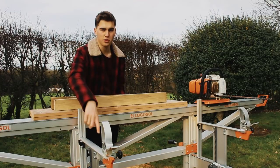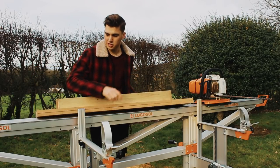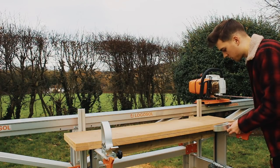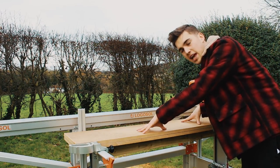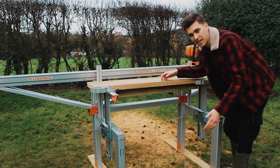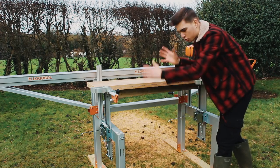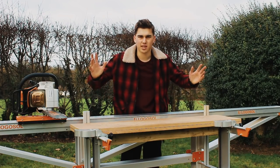The logs I had were just too small to fit on their own between the two log lifters, so I made a base which is basically two sheets of MDF supported with some two-by-fours screwed to it. I placed it on the log lifters, used the clamps to clamp the MDF to the jig, and then screwed the log onto the MDF. Technically this sawmill is a very large jig, and with jigs you can make other jigs to go with it. So if you wanted to cut some wood cookies, you could make a frame which connects onto the log lifters, goes down with a flat on the bottom, then back up — mount a tree vertically and cut cookies. There are so many possibilities for cutting different shapes.